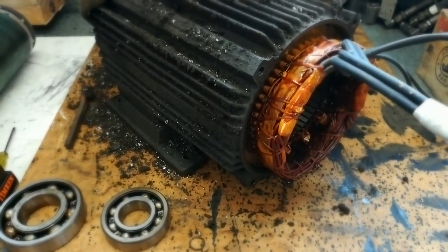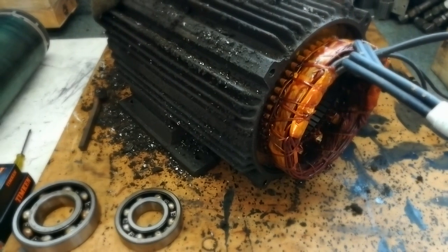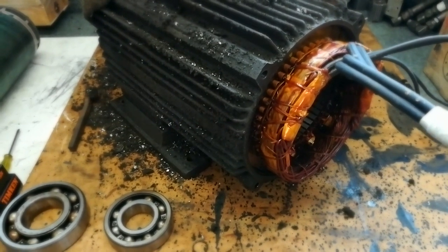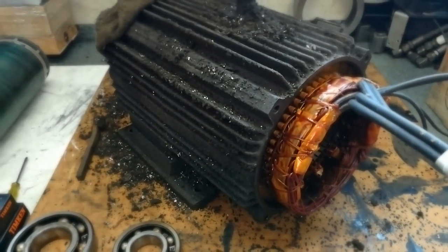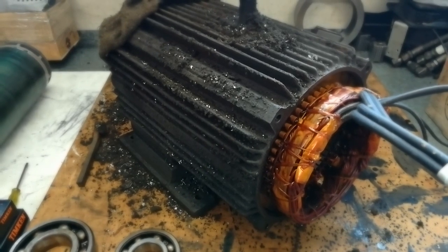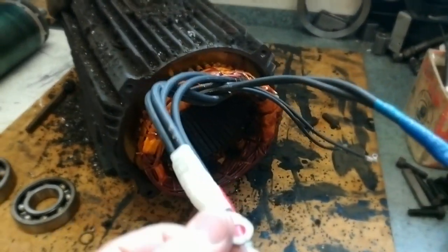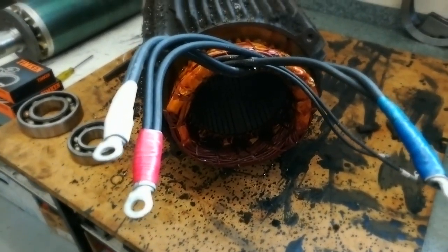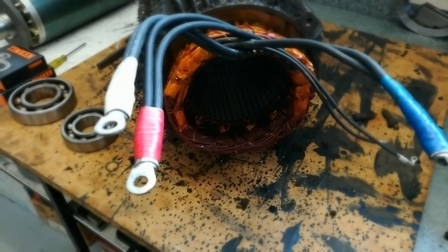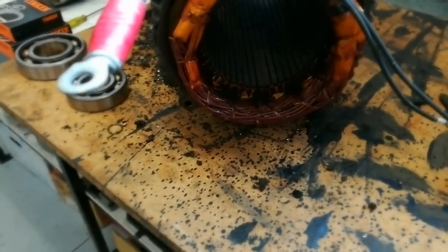Guides and anything that needs to be replaced - obviously I won't be replacing the ball screws, but looking at replacing the linear slides. Anything within reason that needs to be replaced will be replaced, and even some things not within reason. The whole theory behind rebuilding this machine is that mechanically I want to rebuild it to last at least another 20 to 25 years - probably beyond that for the amount of time I'll be using it.